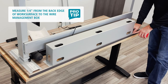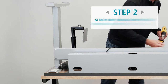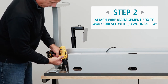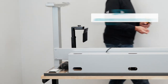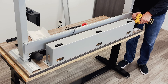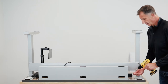Once that's done, it's as simple as just installing the screws. I am using an electric drill with a square drive. This way I do not have to make starter holes — it makes the installation a lot faster. I'm going to put one screw on each side just to make sure I still have it mounted in the right spot. It looks good, so I will put the rest of the screws in.